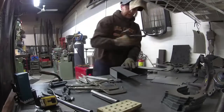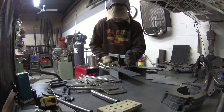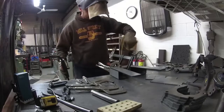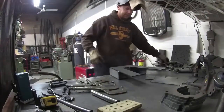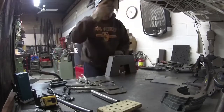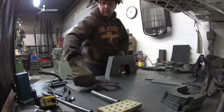Another clamp. Clamp this one down a little bit loosely for now — I'll show you why in a minute. I use a sliding clamp here just because it has more travel. Then watch when you let go — it's going to shift a little bit as it pulls it into that wedge. Then I'm going to put some tacks around the perimeter here. There you have it, that is one step notch. So now you can sit it on your frame. Obviously it's flat here — you may need to just trim that a little bit to get it to fit the curve of your frame rail.